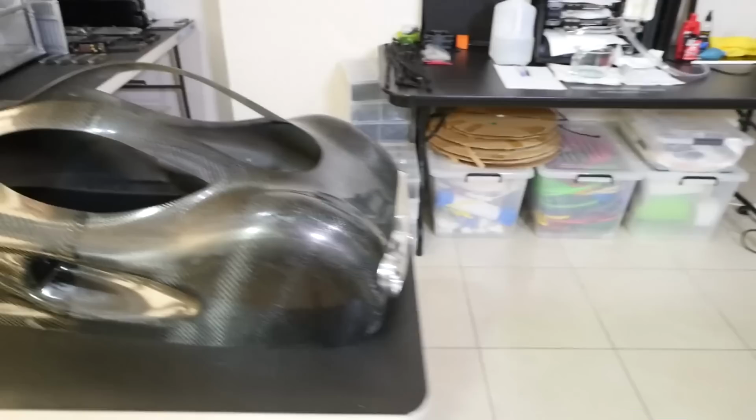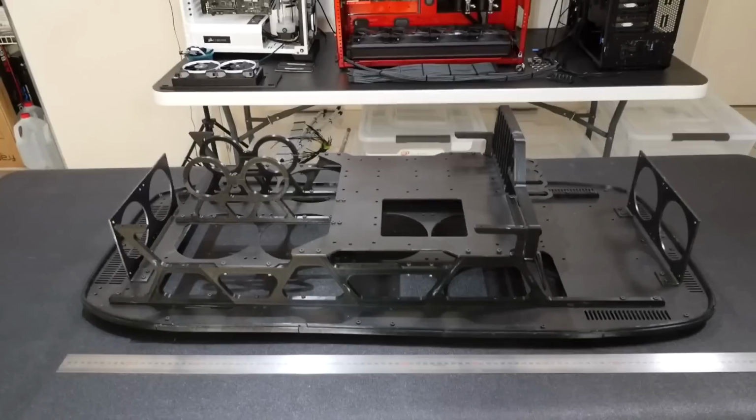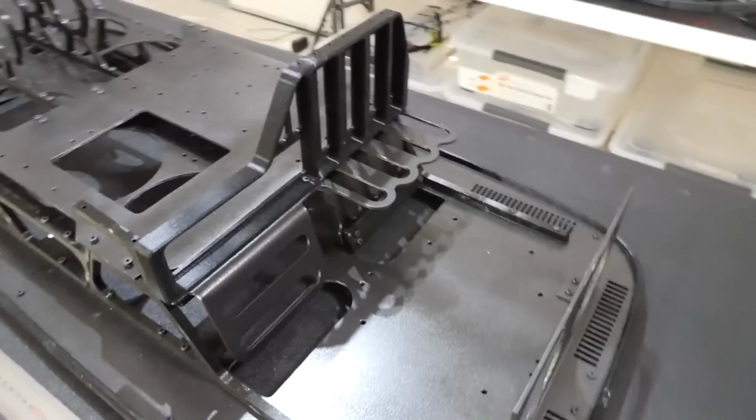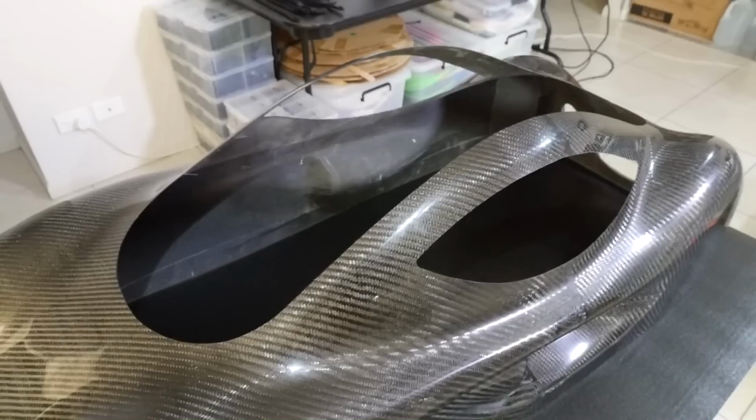We tried to do glass, but it was just another whole area that would have pushed the cost up immensely, and it ended up not really being something that we could do. It's a lot of cost up front, but then mass production makes up for it. For this being limited numbers, and due to the shape of the windows as well, vacuum formed acrylic was the only way to go to maintain the contours of the shell.